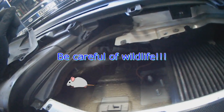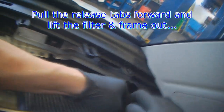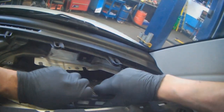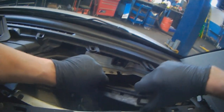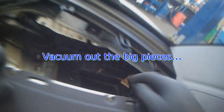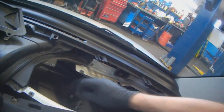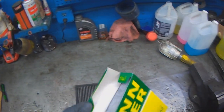If you're lucky, no wildlife is going to run into your face. Here there are some clips, so you release those with one finger and pull up with the other. Kind of grab the filter, pull, and then out to the left. You can get a vacuum cleaner and go in here if you'd like and grab all the big pieces. Worst case, you turn the heater on and then some of the stuff is going to come out of the vents. I will show you how to swap the filters.